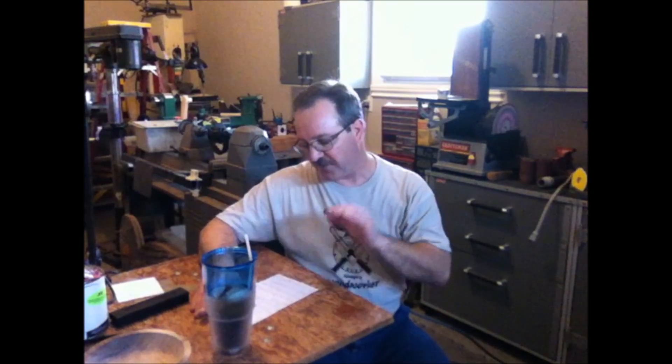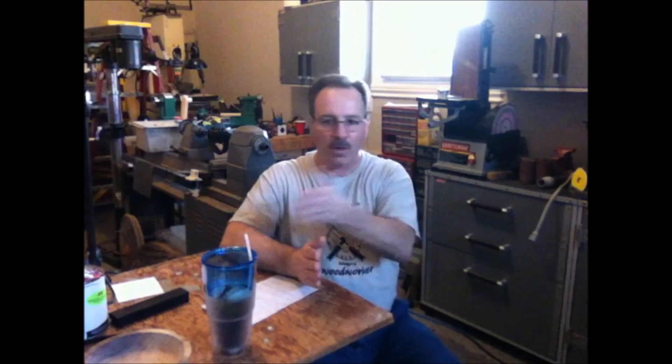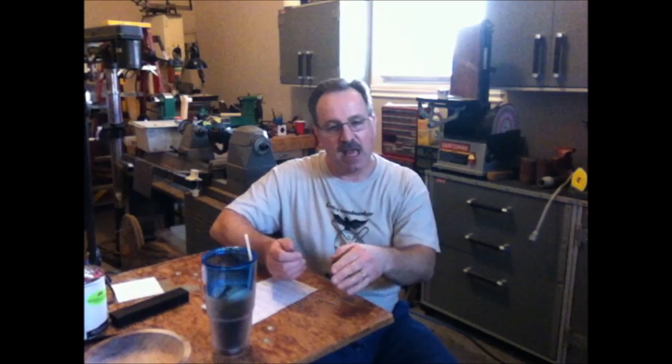Another comment that really got the wheels turning was: if the flaws bother you, change the blank to two fish swimming head to tail. As soon as I read that, my mind started racing. As I make that last outside cut on one side of the blank, I could cut that piece off and basically glue a piece of walnut to the blank, then get my surrogate blank, make my X cuts, and what I'd have would kind of look like the DNA strand with four cherry segments, but then there'd be a little walnut segment on the other end, which could sort of be construed as the tail of a fish.